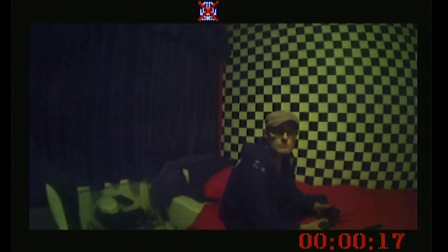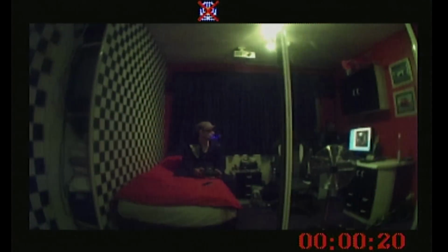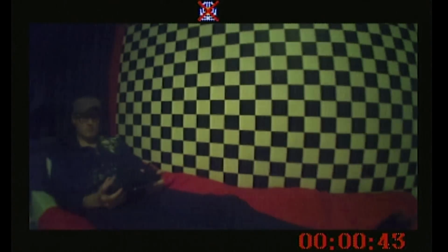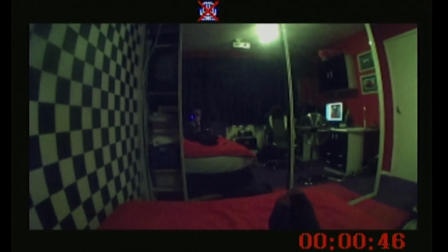So this is the footage from the DVR. As you can see, absolutely no interference from the motors whatsoever. The only noise that I'm getting on the screen is due to the fact that it's really low light. I mean, it is super low light in this room. And second of all, this VTX very nicely comes with its cloverleaf antenna, and I'm not using a cloverleaf antenna on the video receiver. I don't have one that sits in an upright position, so we're getting quite a bit of multipathing there, and that is literally just from the incompatibility between the antennas, which is my fault. You can see I pass through the fan and we get multipathing, but the quality is fantastic.